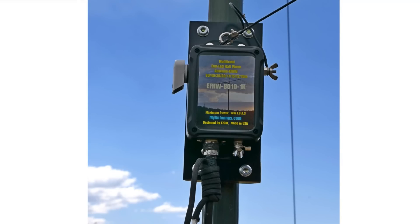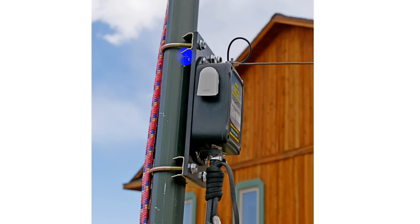This is what the box looks like attached to a pole. This right here is the coax coming in. My experimental antenna port is connected to my lightning arrestor number one, and this piece of coax is 50 feet long and I attach it to whatever antenna I'm testing. This right here is for connection to ground — they even provide a little solder lug you can use, or for a counterpoise. I did not find a need to use it. Note that this needs to be nice and tight. Here's a picture showing how the bolts work — they just barely fit around this pole. If you use a chain link fence top rail as a mast, this will fit on a lot easier.